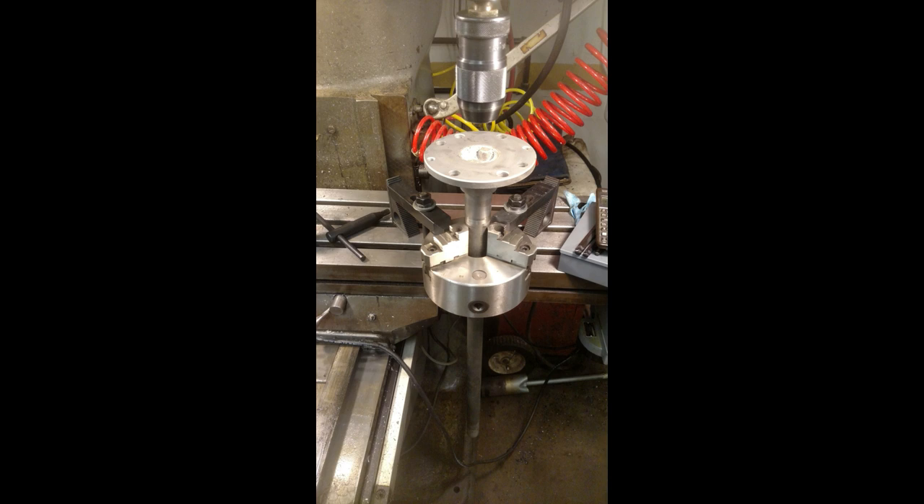I also had to re-drill the bolt pattern on the half shafts, and this shows another really handy technique. I had to hold it vertically and make sure it was nice and perpendicular to the table, so I just took an extra lathe chuck — it's always handy to have one of those around — and clamped that to the table hanging off the edge so I could extend the half shaft down. Then again I dialed in each one individually to make sure it was concentric to the half shaft. I had to make sure I had enough travel because if I moved over too far the bottom of the half shaft would hit the saddle of the table. Even if I'm not hanging it off the edge, it's always handy to have an extra chuck around — if you just need to hold a piece of round stock very firmly, a lathe chuck really can't be beat.